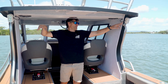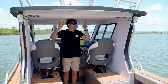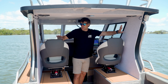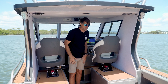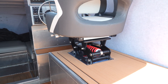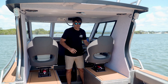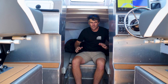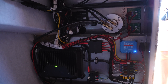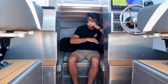Moving into the cabin — we've got twin fully waterproof marine spotlights up here shining down, and a couple of spin-outs to get to everything on the roof. Cabin lights — we've got four, so plenty of light. These are a white and a red, so you can have mood lighting on, not so bright when you're fishing at night. We've done all the carpet and upholstery, with bolsters around there that are nice and comfy when you're on your legs. We've got twin helm seats here — super comfy with bolsters that flip up and flip down. We've got the new BLA suspension seat bases — adjustable, go back and forth, spin round. They really help with the plate boat when you're travelling. All our electrical fit-out with the Garmin and full NMEA 2000 network is super clean, all fusing is labeled, and we give a full schematic drawing and printout of what everything is and where everything's fused.